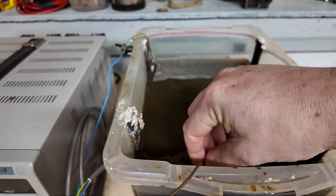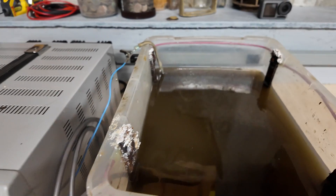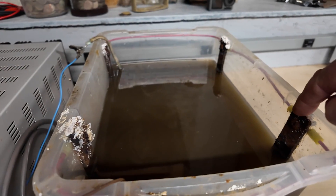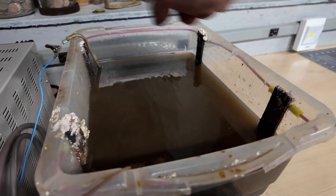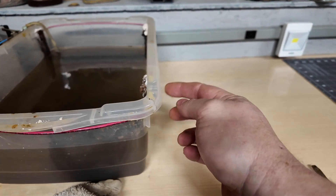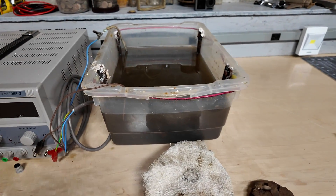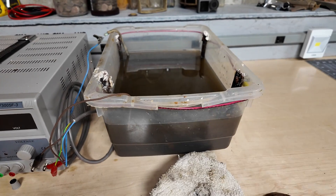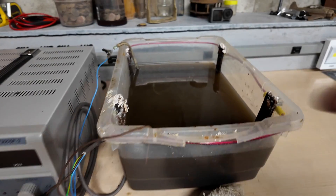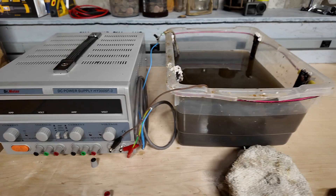Negative goes on your part, positive's over here, and I got a motor brush which seems to be a good conductor. I used to have pieces of steel all the way around with a wire that ran around, and I'd hook my lead up to the bolt there, but these corroded so bad after the first two uses that it doesn't even work anymore.